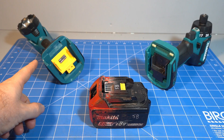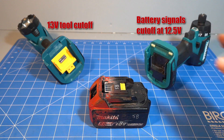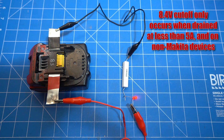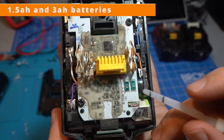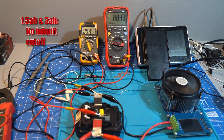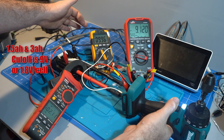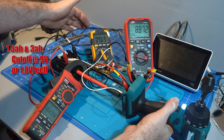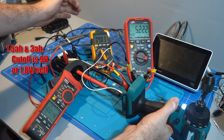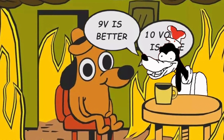In a 2-pin tool, the tool will cut off at 13V. In a 3-pin tool, the battery will signal to stop at 12.5V and the tool will cut out. So the only time this 8.4V cutoff will occur is when you drain it on a non-Makita device at less than 5A. When we look inside 1.5 and 3Ah batteries we see that there are no large MOSFETs. Testing them shows that there is no low voltage cutout either, just a cutoff signal from the D pin. Strangely, the low voltage signal on the 1.5 and 3Ah occurs at 9V — very low, even lower than Milwaukee M18 which was 10V. Makita has intentionally programmed these batteries to run down to 9V on 3-pin tools, and I have no idea why Makita has decided to out-Milwaukee Milwaukee, and also only with their cheaper batteries.